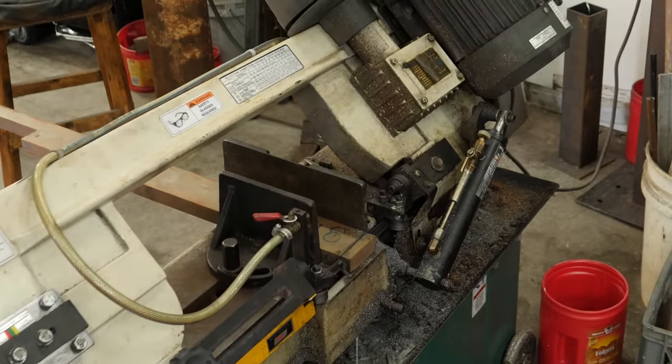For the finish we're going to use Spray Max 2K. The 2K means two-component — there's a little container inside that you actually break open and mix in with the rest of it. Once you do that you have a limited shelf life because it'll start to harden even in the can. After releasing the catalyst and shaking, that's already looking really cool. After doing our first three coats I let the handle dry for 24 hours, then scuff up the finish with 600-grit sandpaper so the next three coats will adhere to the first three coats better.